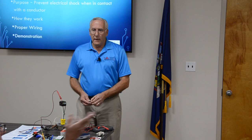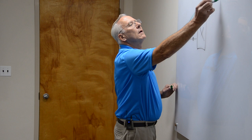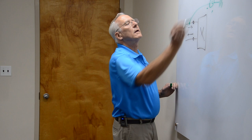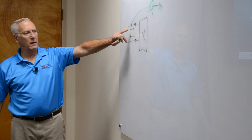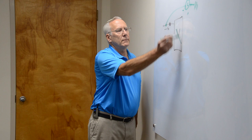No, it's because I plugged that probe here, and I had it plugged to a ground. Right, here's my test light. That's this, this is the probe. That little white wire connected to steel is this. All I did was hit the ground, hit the hot, and it dumped it. Why? Because it didn't see anything right here. It had nothing to do with the ground. It didn't see anything right there. It tripped, and it dumped it. You saw it. You understand that?